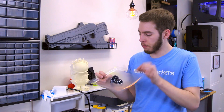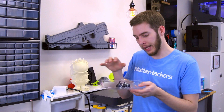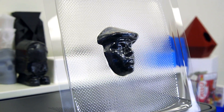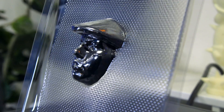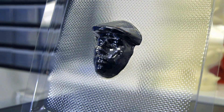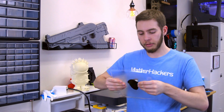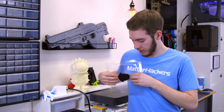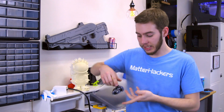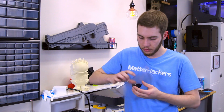This is the third one that I pulled, and this one came out the best. There's still a little webbing right here, but it's not too noticeable. I used my thumbnail to just kind of rub it in and get it better. One thing I noticed is the bill of my hat — I didn't do a perfect job smoothing it out, so there is a very slight undercut, and it does take a little work to get it out. But the fact that I acetone-smoothed it did make it a lot easier. The technique I'm developing as I go is to hold the plastic so I'm not bending it while trying to pull it out. I can see where there are air pockets just based on how it looks through the plastic, so this should come out pretty easily now.